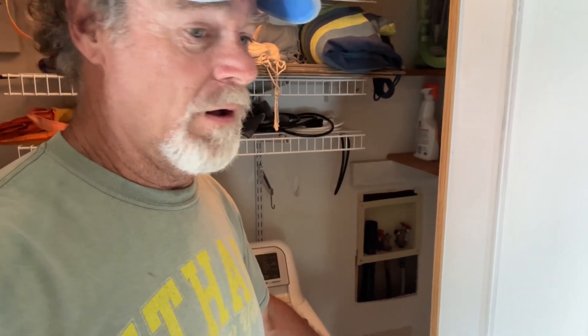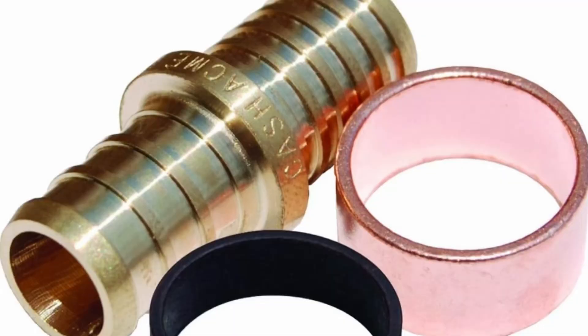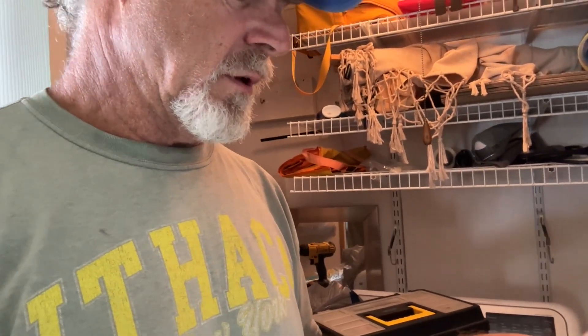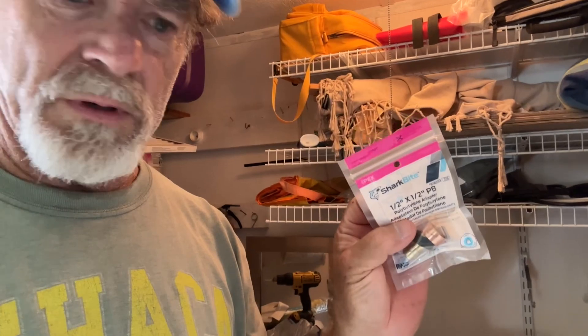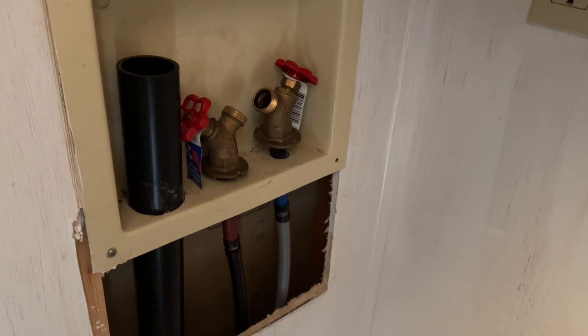Anyway, I digress. What I've got to show you is this little gadget — a very handy kit. It comes with a lighter-colored crimp ring for polybutylene and a darker copper crimp ring for PEX. This will adapt polybutylene to PEX pipe, which I have a supply of. Anytime I'm pulling out polybutylene to repair it, I replace as much as I can. So I'm going to cut down to the leaking section and adapt it right now with this kit.